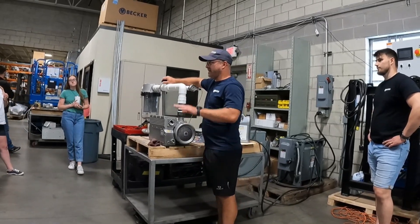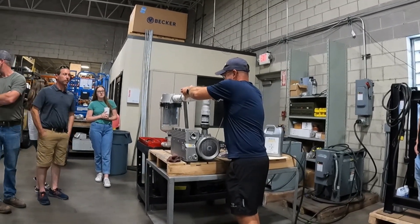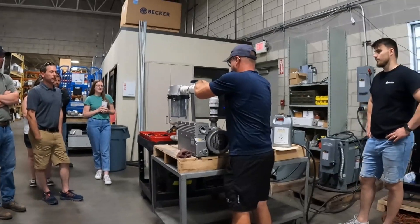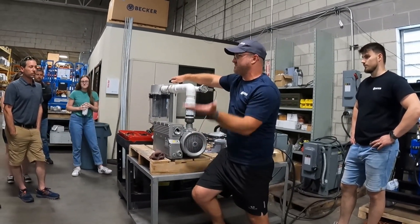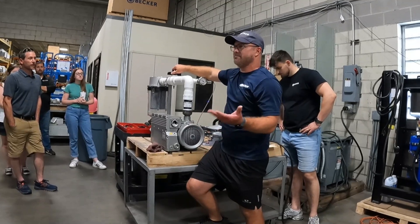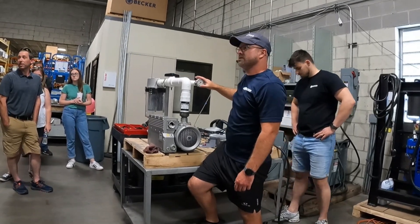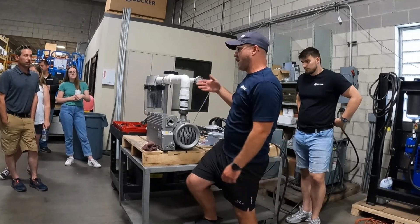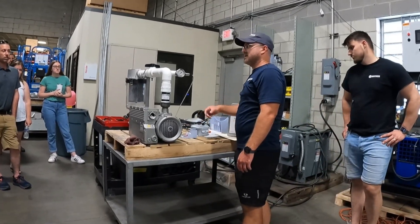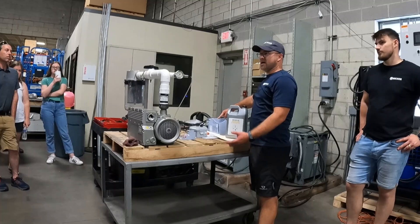It's at 29 inches right now and idling at 30 hertz, so we're going to simulate demand. Now there's increased demand so the pump's going to speed up to compensate — we're about 24 inches of mercury right now, running at pretty much 60 hertz. As the demand decreases it will ramp back up. We still install a liquid gauge; I like that visibility in front of your face all the time. This hand mode is in case something happens to the transducer circuit — you can physically use the drive buttons to tell it where you want it to run.